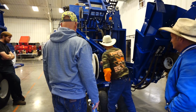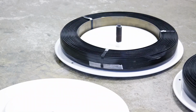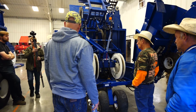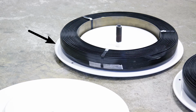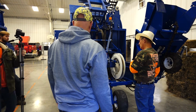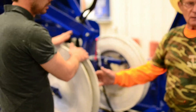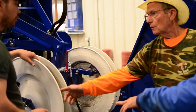So yeah, you pull these clips, this slides off, the wing nuts come off, these split. The banding has three metal clips around it. So you just take your tin snips, pliers, whatever, cut those. Make sure that you put them on the spool before you cut the clips. And when you cut the clips, yank them out and put the top on. Are there a left and a right? Because the inside's different. No, these spools are interchangeable left and right. You're just buying the strapping.